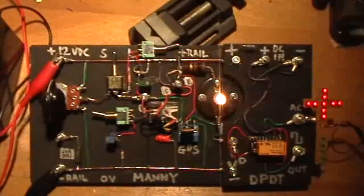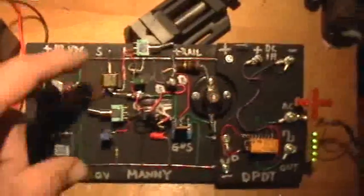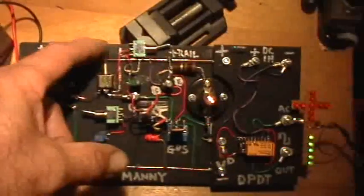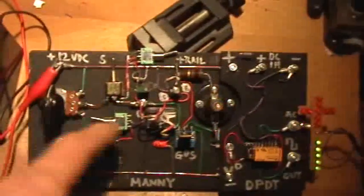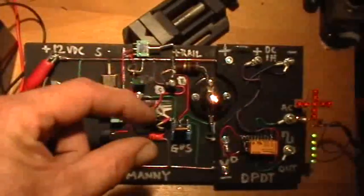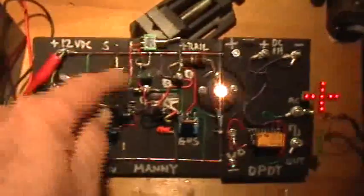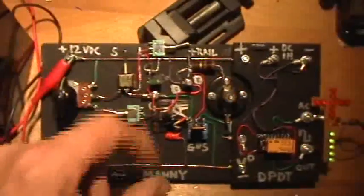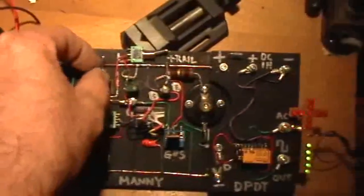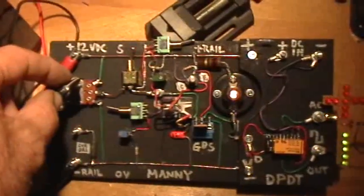It's got 33 microfarads. The gate discharged now because it was charged to a full 12 volts by this switch going over to the left. And then it took that long for that full 12 volts to drop back down to the 4-volt fluctuating level once we released the charge input to the gate. And now it's back oscillating again at the fixed rate. I can also go to the variable rate here, where the oscillations are controlled by this rheostat.